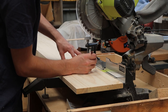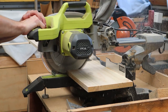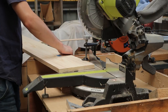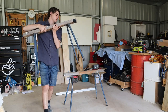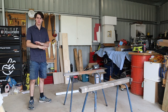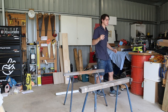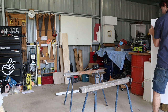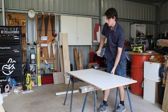If you're cutting more than one board to the same size, a good trick is to line one on top of the other and mark it — that way you know it's always the right size. Odds are you're going to have some off-cuts but don't throw them away because we will use them later. Now when assembling, every other video on YouTube has a giant workbench all set up. I have a workbench but it's pretty tiny, so what I do more often than not is just grab two sawhorses and a sheet of wood as a workbench.